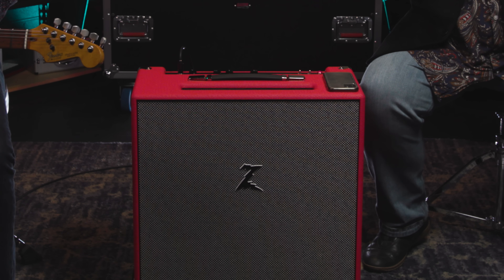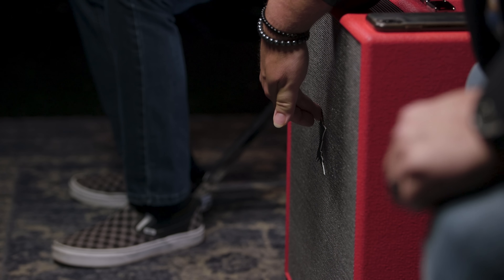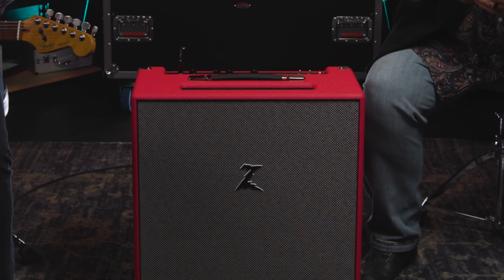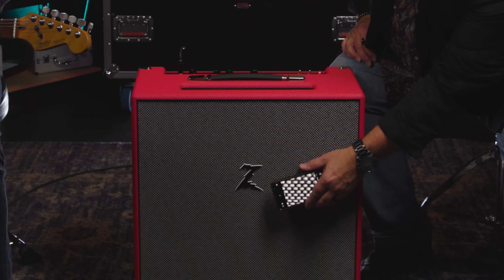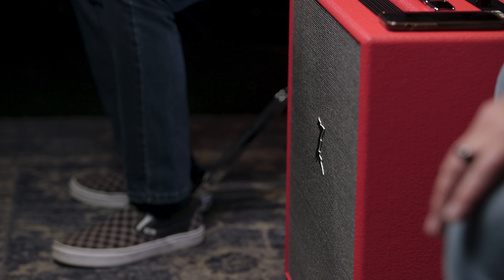If it's a sealed cabinet without a vent you can look through, you need to figure it out through the front of the amplifier. There are two things you can try. First, you can actually feel where the edge of the speaker is — in this case our 12-inch speaker is right here in the center, so you can do it by touch depending on how far the grill cloth is from the actual baffle. The second technique is to use a flashlight — and we all pretty much have one in our pocket with our smartphones. Put that up against the grill and, depending on how dense the grill cloth is, you'll be able to see where the edge of the speaker is and locate it.